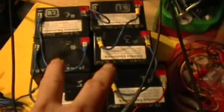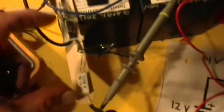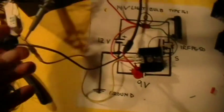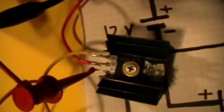And finally, I've got the full 72-volt battery stack there. Red, black, red, black, red, black, red, black, red, black, red to the Kelvin probe, ordinary current sense unit. Okay, and the channel 1 probe is connected on the transistor side. There's the function generator input lead. I can put that all the way back to the main battery side, I guess, there, okay. Oops. Okay. So that's there. Everything else is wired just as before. You can see what the connections are at the MOSFET.